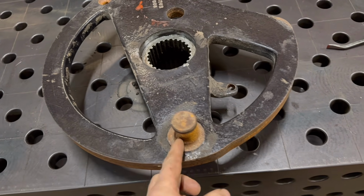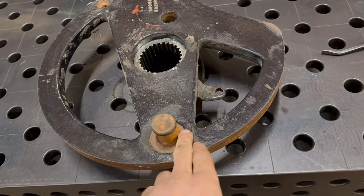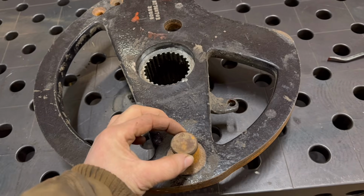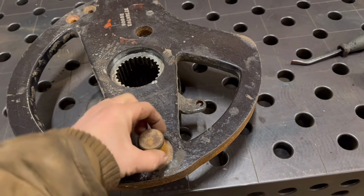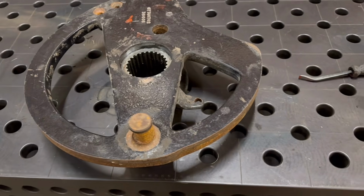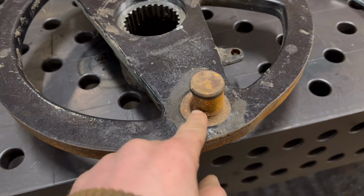And if it's going to be all right, I suppose I can use cast rods if it does go hard. And I'll put it on the mill, find the middle of that, and use the boring head to bore it down slightly smaller, and then build it back up. Clean up with the wire wheel, and then we'll put a bit of weld on it.